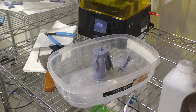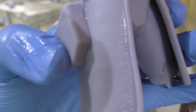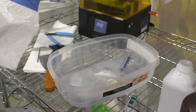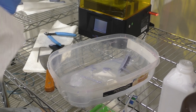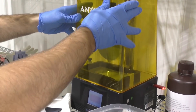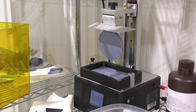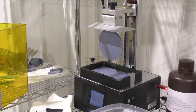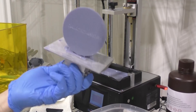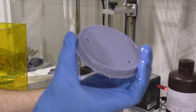Now that it's cleaned off, let's take a closer look at some of the details. When the camera focuses you can see the stitching pattern on the armor, all of the lines on the groin piece and the waist, and the little thermal detonator on the back side with all of its buttons. I'm just really pleased with how much detail the printer was able to get from the model. The second piece I wanted to look at was the platform the whole thing is going to stand on. I had very little hope that it would print well — it's printed on its side, kind of tilted, with very little connecting it to the build plate. I thought for sure it was going to fall off, but to my pleasant surprise it all worked out fine. The supports came right off, and with just a little sanding I can smooth out the edge, and you can barely even tell what side it was printed on.